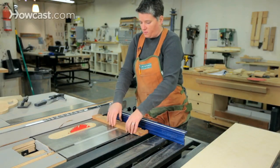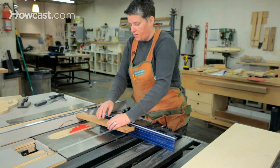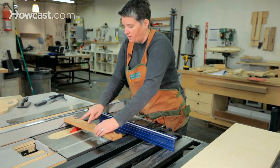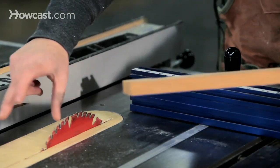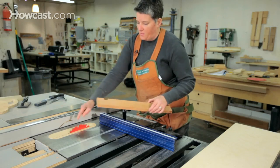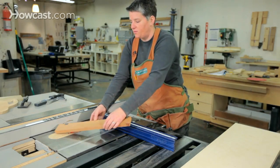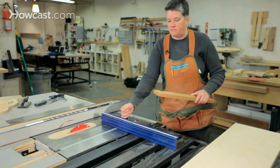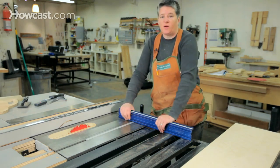What happens when you do that is dangerous. It's actually fine at the beginning of the cut, but when you get to the end and the pieces become separated from each other, you're still pushing one forward. The other starts to tip and turn into the back of the blade. The back of the blade is coming out of the table with a lot of force, and that piece of wood gets caught on the blade and kicks back at you. If you're in that line, you're going to get a piece of wood in the head or chest — it won't kill you, but it's very painful.